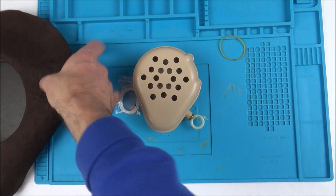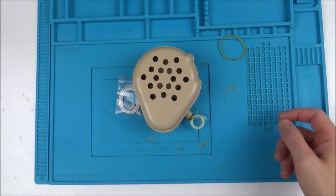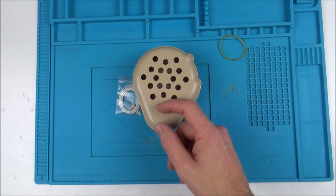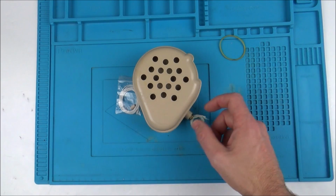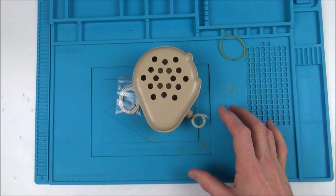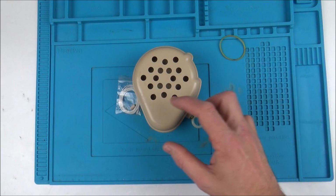So there's something in there, I don't know about this one, but normally you have something called, I think, a governor or a regulator, and it slows it down. It's like a big weight that as it starts to spin, spreads out, hits against the plastic with some kind of felt pads, and slows it down so it spins nice and slowly. Because when you pull this out, all you're doing is tensioning up a spring that wants to release all its energy straight away. But by having the regulator or the governor in it, it stops it from releasing it all within one second. So it takes a few seconds.